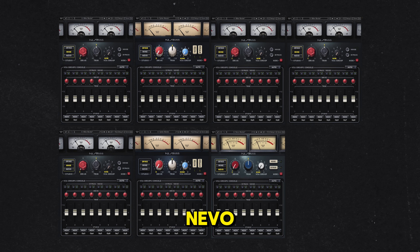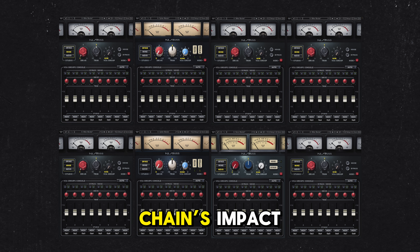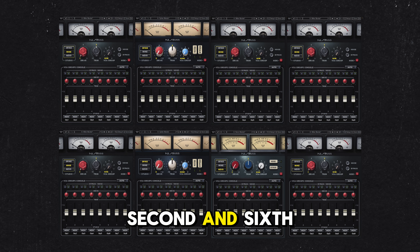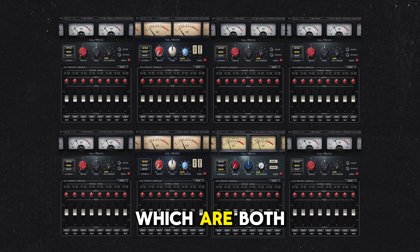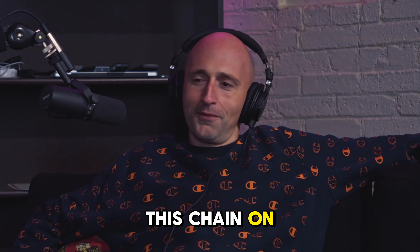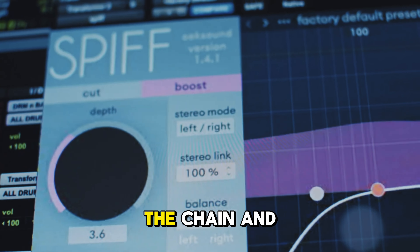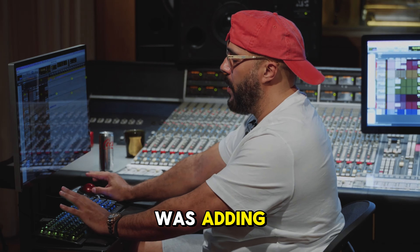What is summing in both the analog and digital domains, and why should you care? Analog summing uses physical circuits to combine multiple audio signals into a single output. These circuits have headroom, allowing them to handle levels above 0 decibels without clipping. This headroom creates a safe zone for transients, letting them come through without harshness.